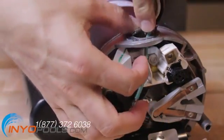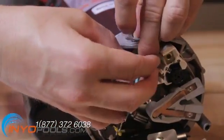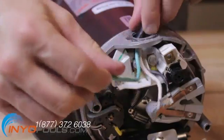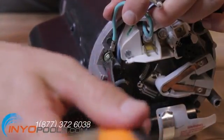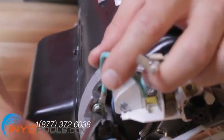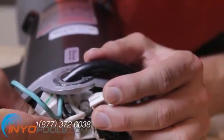If you are wiring for 115 volts, the three wires to the pool pump will be black, white, and green. Attach the green wire under the ground screw. Attach the white wire to terminal 1 of line 1. Attach the black wire to terminal 3 of line 2.